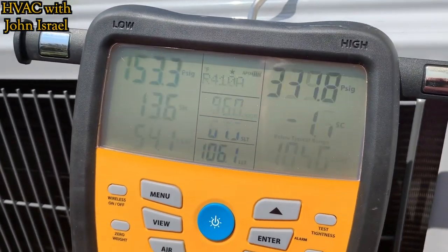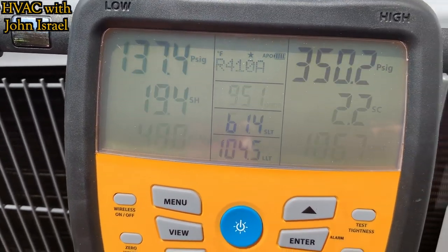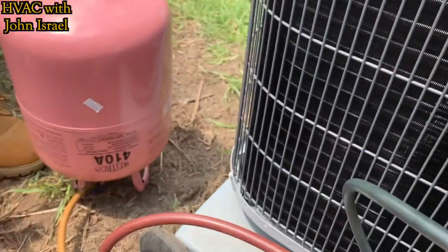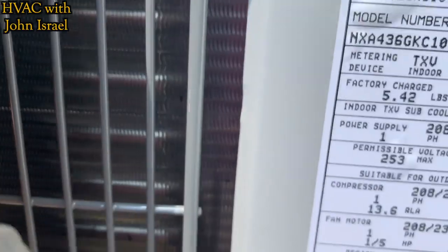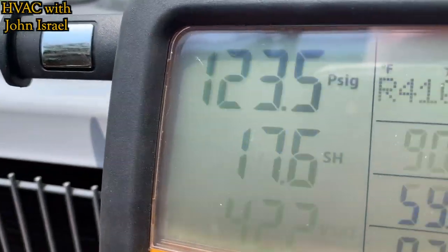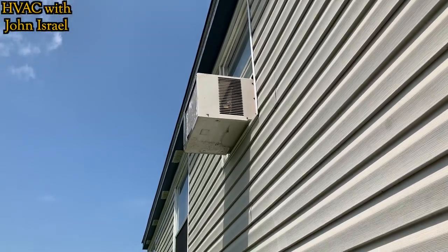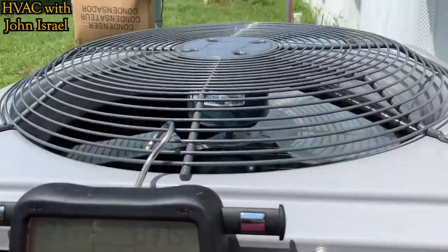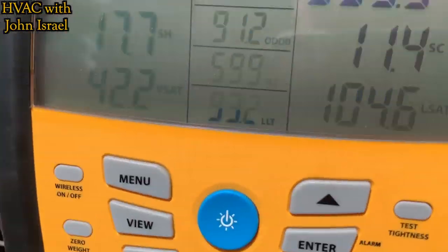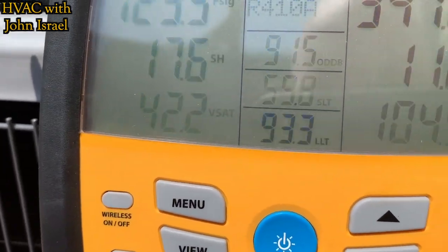The ICP's nice and quiet. Sweet unit. We're going to let her run about 10-15 minutes. I had to add just a little bit of gas. Our target subcooling is 11 degrees — we're at 11.4 on a 17 superheat. It's not that hot in the house because they have a couple of window units in there; they've been out of air for a few days and had to get their money together to do this job. So they've got two or three window units keeping them cool, meaning the house is not hot. I'd like to see the superheat a little lower, but it's coming down. We're looking good.